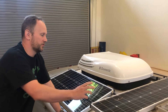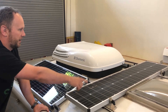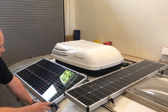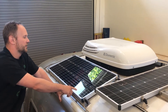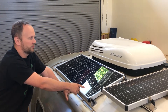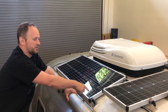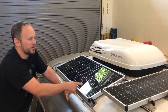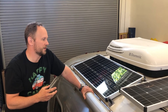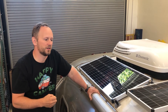If you look closely at these panels, you'll notice that the XAMP 90-watt long panel has 36 half cells to give it an operating voltage of about 18 volts, whereas our custom 98-watt XAMP panel uses 39 half cells to give it an operating voltage of about 19.5 to 20 volts. The current of the panels is going to be the same because they all use half cells connected in series. With that voltage differential, it causes a bit of a problem when you connect panels in parallel, but the series connection for our three-by-three configuration isn't going to be an issue.